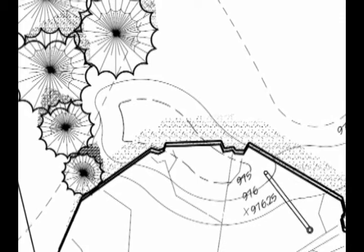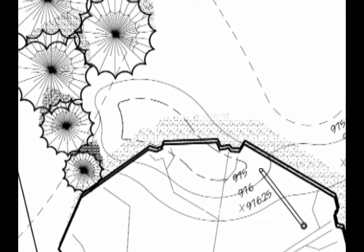Originally, these were made V-shaped or bowl-shaped, but that creates the risk of having a really wet, saturated area for extended periods and then really dry areas elsewhere. We're not getting the same type of infiltration and evaporation that we would if we spread it out nice and evenly. So that dotted area is the rain garden basin.